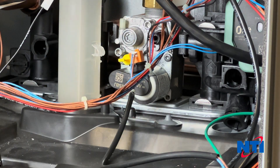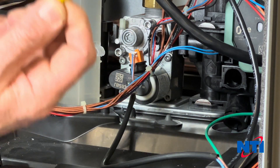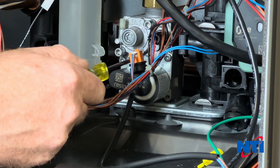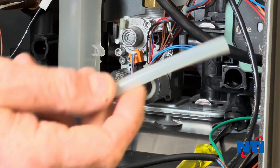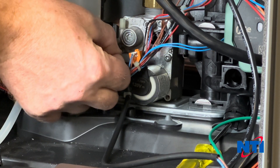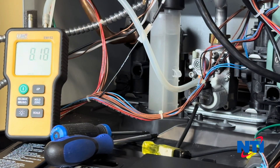In order to set your valve properly you need to do three different things. First, check your gas pressure. To start, remove the yellow cap, then take a Torx T10 screwdriver and loosen the incoming test port screw about two turns. Hook your manometer tubing up over the test port — these can be a little tricky but with some patience they will go on. Verify that your gas pressure is adequate for the fuel you're burning; in this case, natural gas, eight inches of water column is okay.